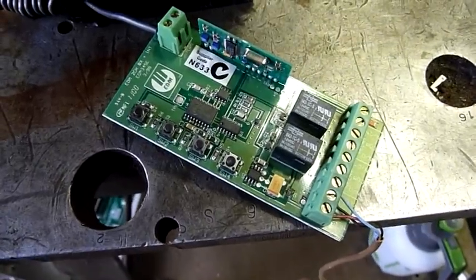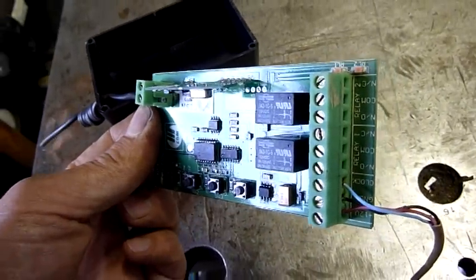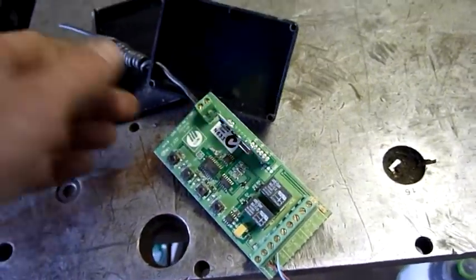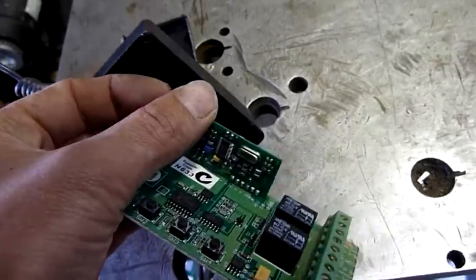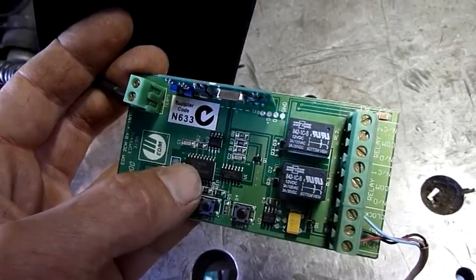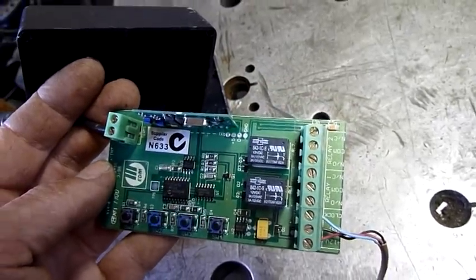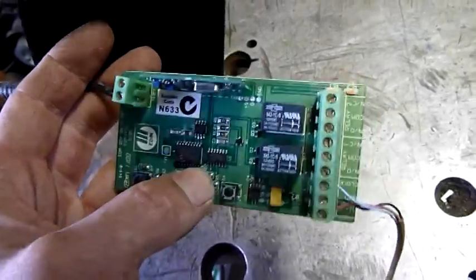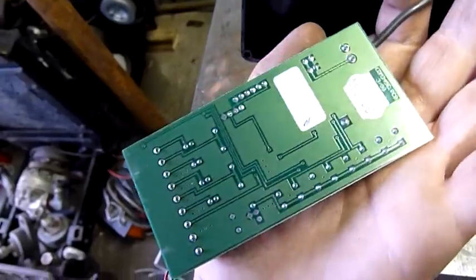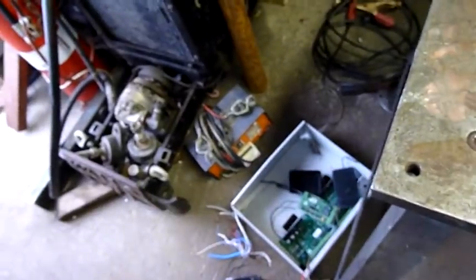That's the controller — and it's remarkably similar to one I built into a swimming pool cover controller. It had it triggering reverse relays using the normally open contacts and the two-channel remote. You just set it to flip-flop mode on one channel and normal on the other, and away you go. This one has a PIC-16C54 by Microchip, a couple of little generic relays, and a push-button probably for programming individual remotes — you can probably have four different remotes. Just more stuff we don't really need.